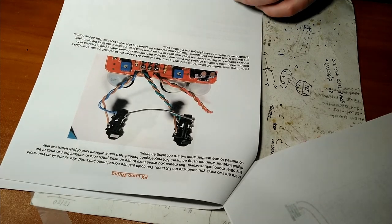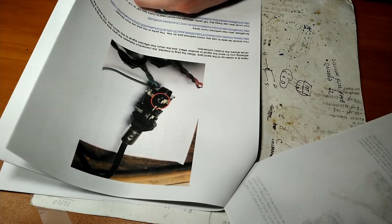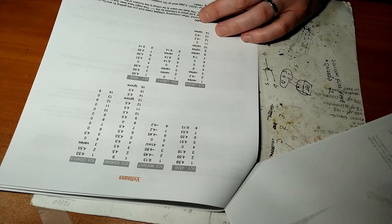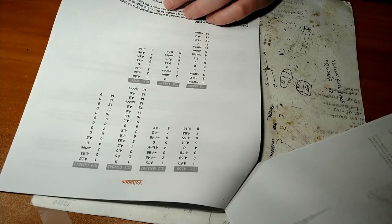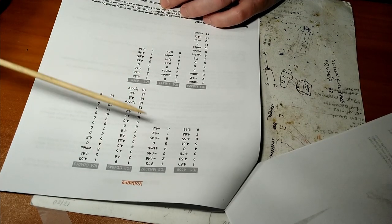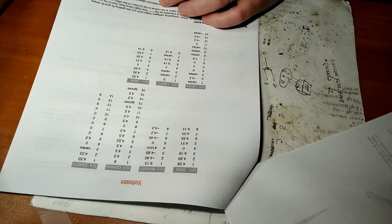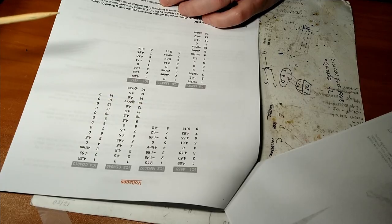Effects loop, we won't be messing with that, I don't think. More blah, blah, blah. Voltages. Oh yeah, I have a troubleshooting guide, so for this particular pedal with the trimmers, we're actually going to have to get in there with the multimeter and set some voltages, so we'll get there when we get there, but this would be the first time I've had to do this. Most pedals, like if you want to build a Tube Screamer, or a Brian May screamer, they're a lot simpler. You can just set it and forget it and it goes.